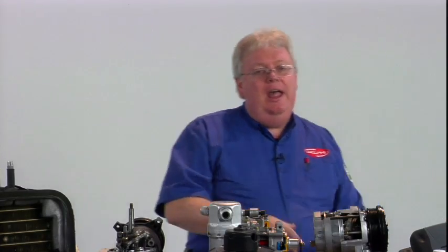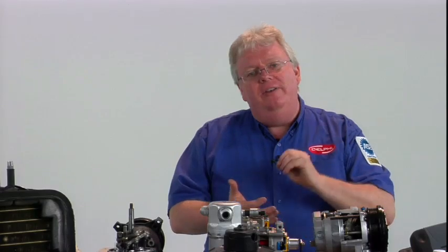So we can't just add a half a pound. The refrigerant is going to have to be removed and weighed, or tested for how much you pulled out with a recovery machine, and then charged up with a precise amount — the amount the system is supposed to have.